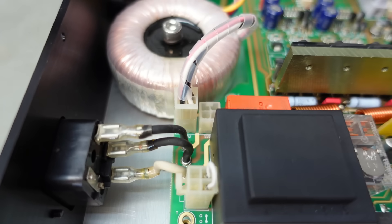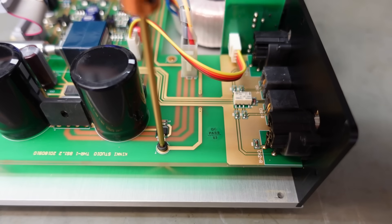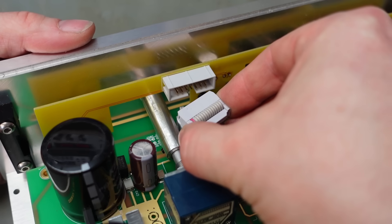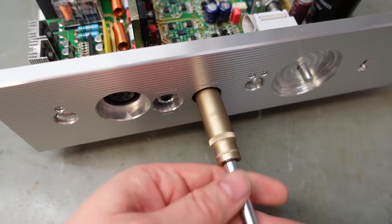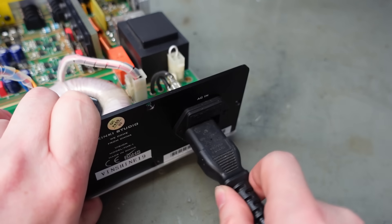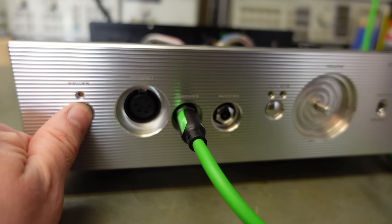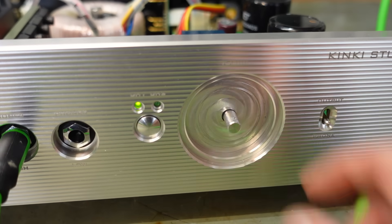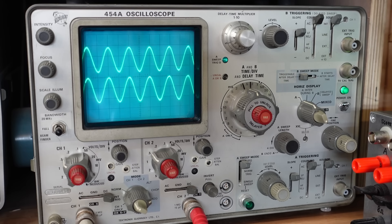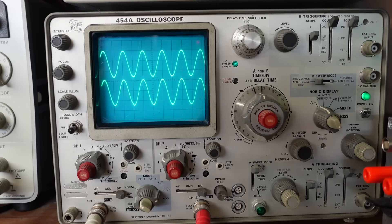Putting it in the 230-volt socket with the secondary connected. Pop a couple of screws in, and of course the front panel on. Let's hope it plays nicely and doesn't blow up. Power on - well that looks like it's working. Let's try the volume - yes, that's fine. The output switch turns the output off as expected. Nothing in channel two, and it also drops the headphone output off. The low impedance output works the same.